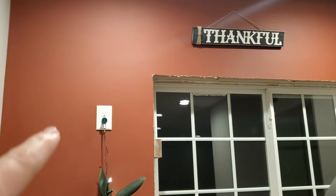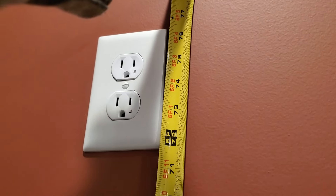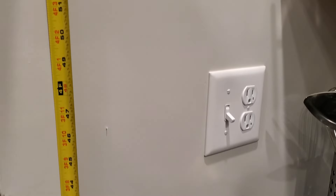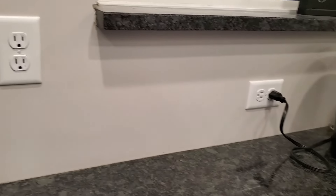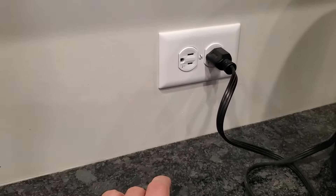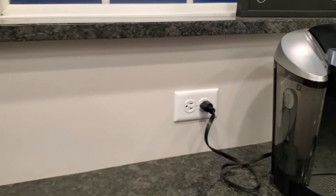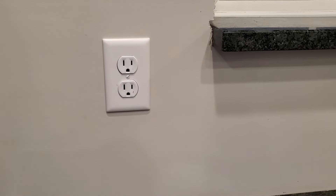Here's an implementation of adding an outlet up near the top of the window. The height that I set those receptacles at is six feet to the bottom of the receptacle. The height of the outlets — and in this case there's an under-counter light switch — is also set to 48 inches. Note that if you run into a situation where you can't get your receptacle all the way up to 48 inches, it's fine — you can drop it down a little bit. Just try to keep it up off the counter enough to have room for backsplash. If you need to shift them a little bit, it's totally fine, but for uniformity's sake, if you can just set the top to 48 inches, it seems to make good sense.